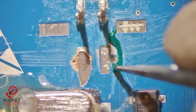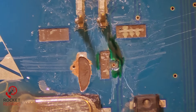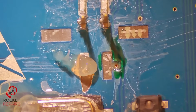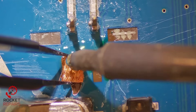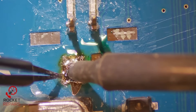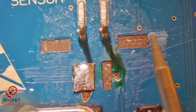There's a big plastic connector right next to it which makes it a little bit more awkward. That looks a bit better — more protected at least. That's looking a little bit more secure. Now I'm going to put some flux here and tin the area, and then put this exactly where it needs to go. That will be solid for us to connect the connector to. Same rules apply — except we're scratching the ground here, and this side as well.